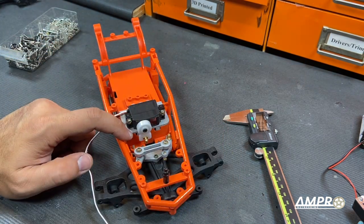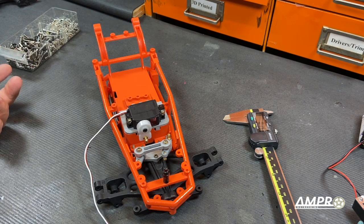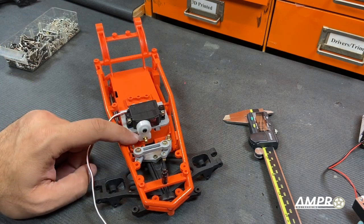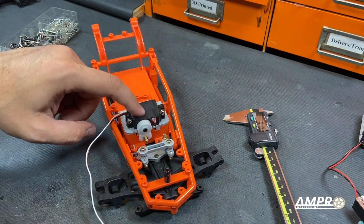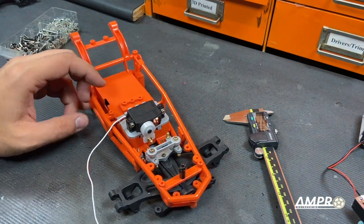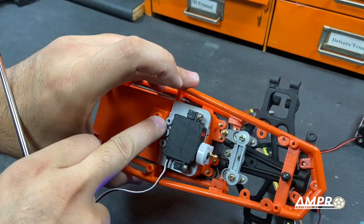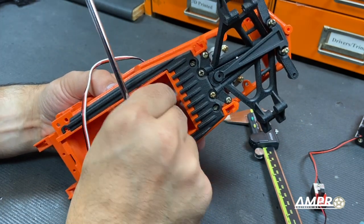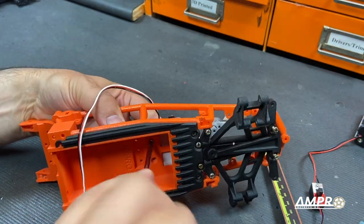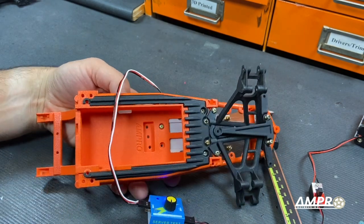I had to drill a hole in this Kimbrough Servo Saver because it did not have a center mount for the ball stud. The ball stud is, again, another standard Tamiya M3 ball stud, and I did have to put a regular nut on the backside, not a lock nut, as it won't fit. To hold this down in place, use two 12mm long screws from the inside. This was done this way to prevent anybody from putting a screw that's too long in from the other side and potentially hitting the battery.